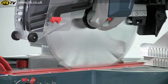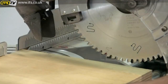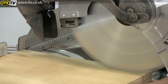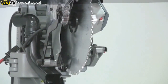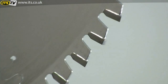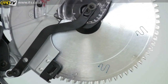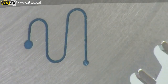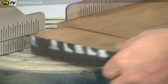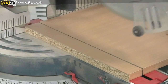It also has a very efficient brake so the blade comes to a halt quickly when you switch off. The standard 305 mm diameter 72-tooth blade supplied with the machine has been specially designed for this saw, featuring high quality TCT teeth, a chrome coating, and slots filled with polyurethane to reduce vibration — so it's very quiet. It cuts incredibly smoothly and leaves a super fine finish even on laminate or veneered surfaces.